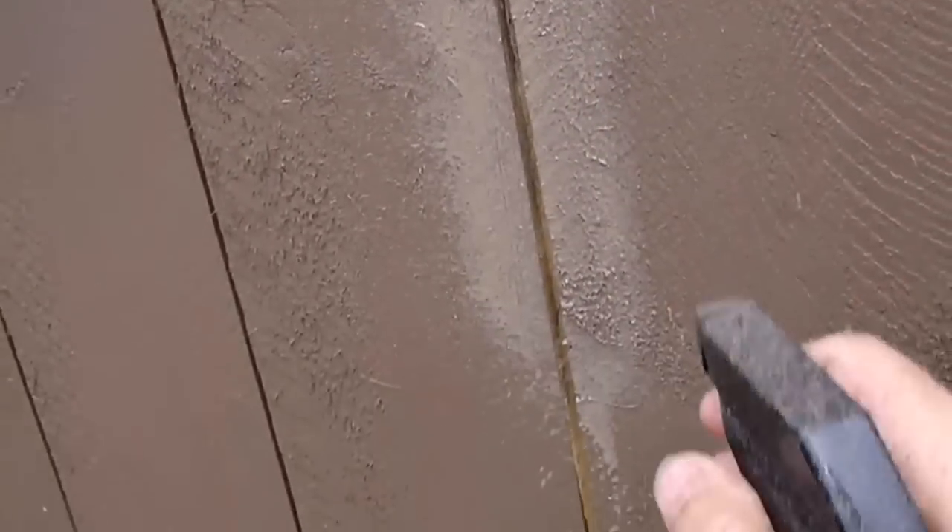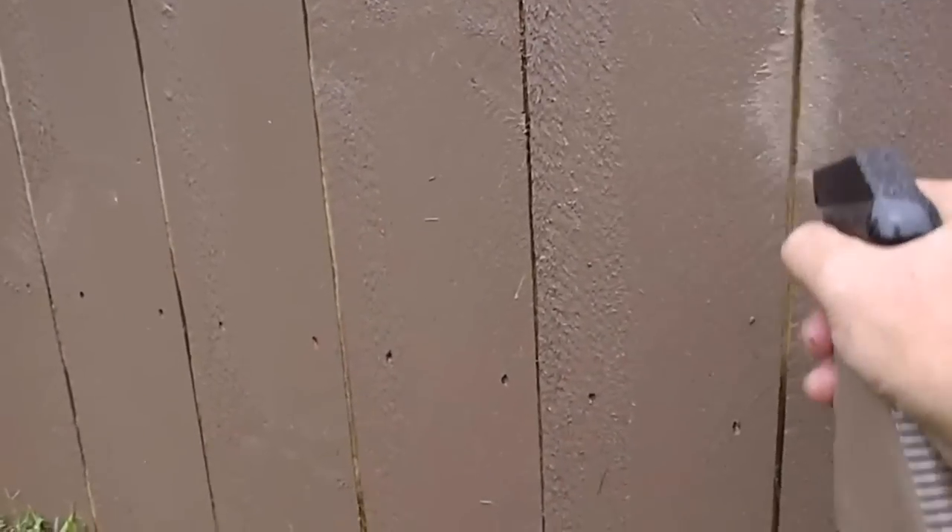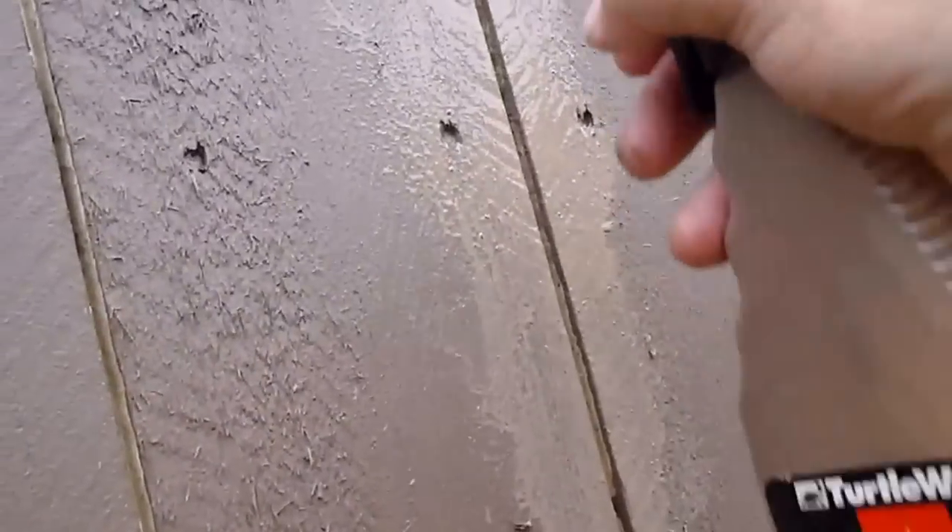Here's another example — you can see that in there. You just stain the panel, then squirt, squirt, squirt in between the slats. The thing is, you don't have to do every board — you only do the ones that stand out, the ones people are going to notice. If you're a perfectionist like I am, you know that when you get finished with your work and hang it up, that's when you see all your imperfections. That's when you think: I could have done that when it was easy. So there you go — that's what I figured out, and this is what worked completely for me. That's what the wet product looks like, there are the water runs coming down the front, and when it dries up the finished product is going to look like this — no standout marks in between the slats.